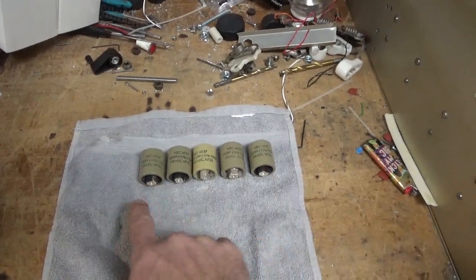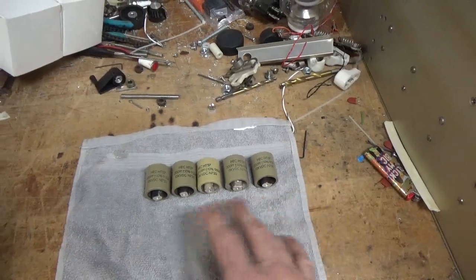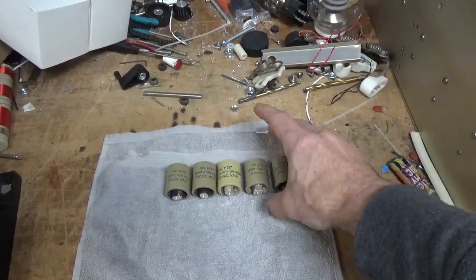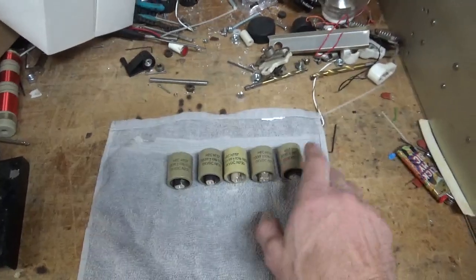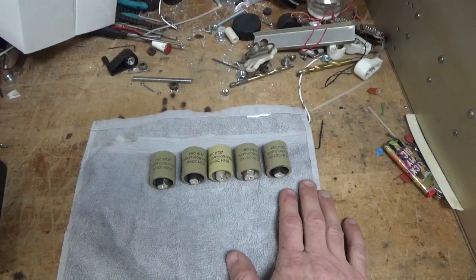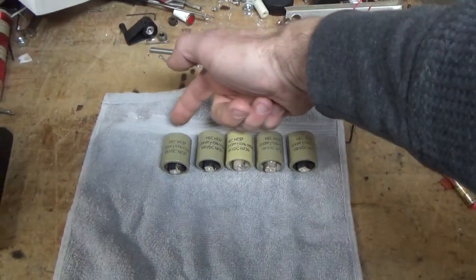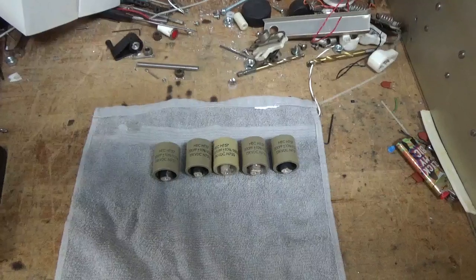So I'll high-pot them, then I'm going to take this copper material, mark the holes, punch it, and so on. I'm going to have all five in parallel, so I'll have roughly 1,000 pF — plus or minus 10% — more than enough current handling capability. I'm going to feed one end on the bottom and the other connection will be at the top, so the current distribution will be equal.